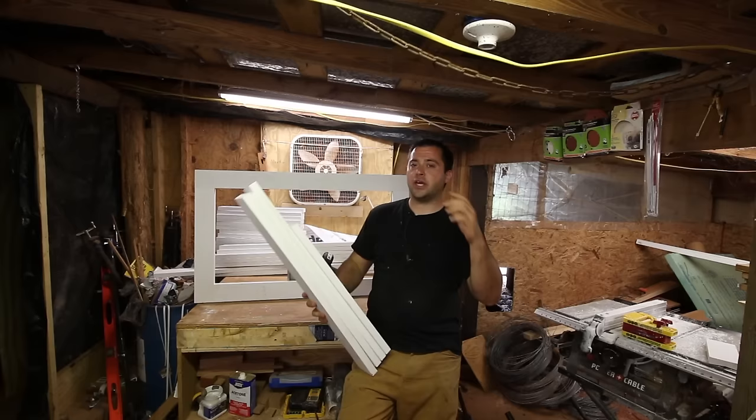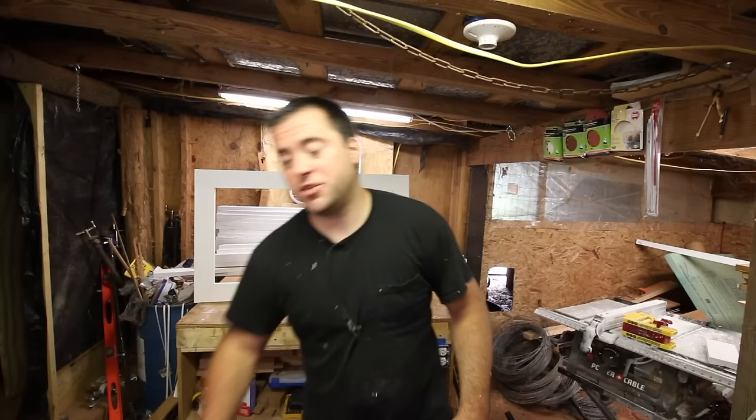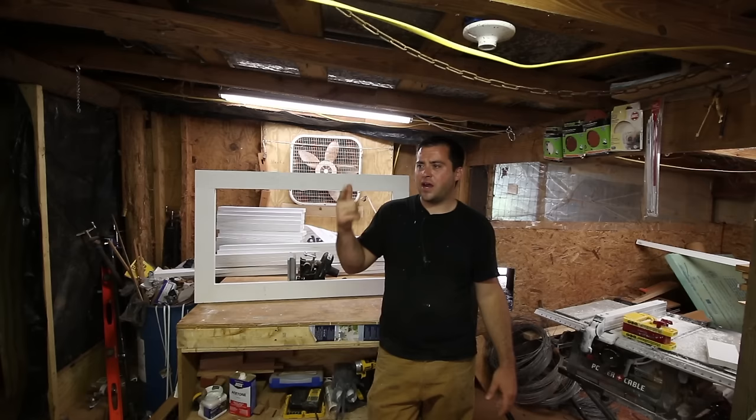I took a 12-footer and I cut all my 22-inch pieces out of it, when I could have gotten a 40-inch piece out of it and then a 30-inch and a 22-inch, and that would have been the best way to utilize my material. So always start with your longest numbers and work your way back. I don't know why I did that.